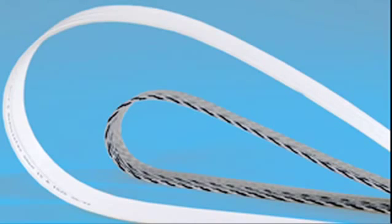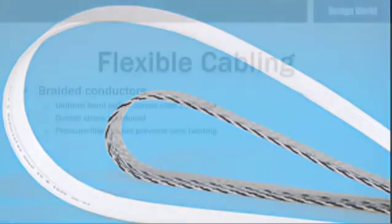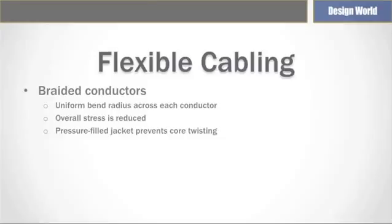This can work quite well because the elasticity of the materials is still sufficient, but material fatigue can set in and cause permanent deformations. The cores move and begin to make their own compressing and stretching zones, which can lead to a corkscrew shape and ultimately core rupture.